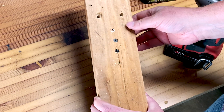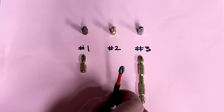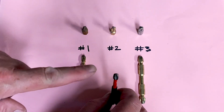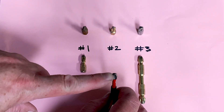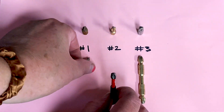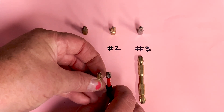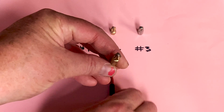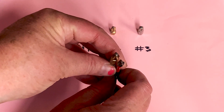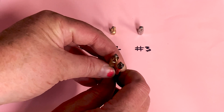These are your three sizes of screw driving bits that you will be using. You will most likely be using the number two. The number two has the right size for most of the drywall screws and construction screws that we use. Number one has a tinier tip and is used for smaller screws with smaller heads. The number three is an even bigger head for larger screws — number 10, number 12, number 14, and that size of screws.